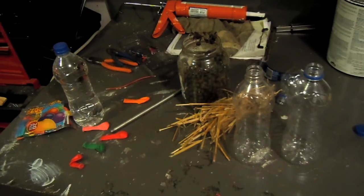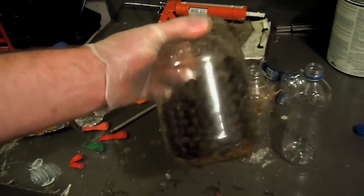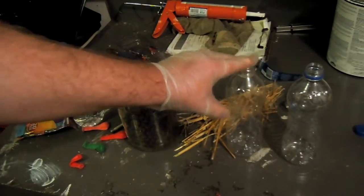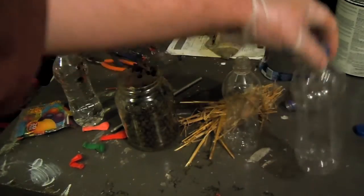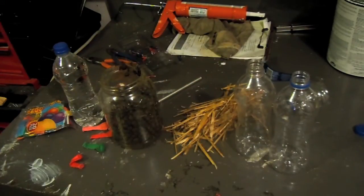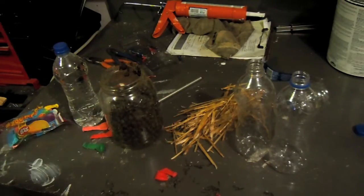I took a class on agricultural incidents and asked an instructor about it, and basically he said if you want to know, just try it. So that's what I'm doing. I've got a jar of fresh rabbit manure, some rubber gloves, and a couple of jars. One jar will be straight rabbit manure with a little water to make a slurry; the other I'll mix in some old straw to bring the carbon content up. Then I'll put a balloon over the top to catch the gas. Biogas generates best at higher temperatures, around 95–100 degrees.